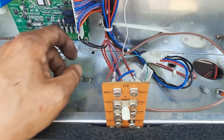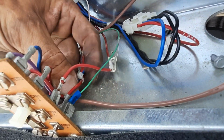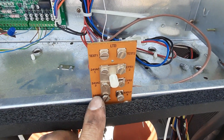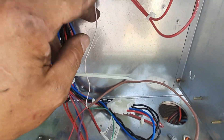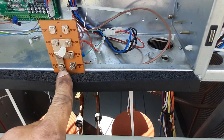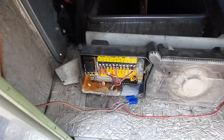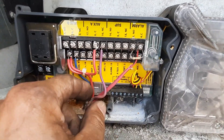Back to our smoke detector — you've got to remove your jumper from your e-stop terminals. There's only one wire connected to it, that red wire, and that feeds power back over to our phase monitor and all that. We've got 24 volts jumped out, feeding power to our smoke detector. We catch our common power right here on the common terminal block, and as long as that contact's closed we're going to feed to here and have normal operation. When that contact opens, on our terminal 16 normally closed, it kills power to everything and shuts everything down.